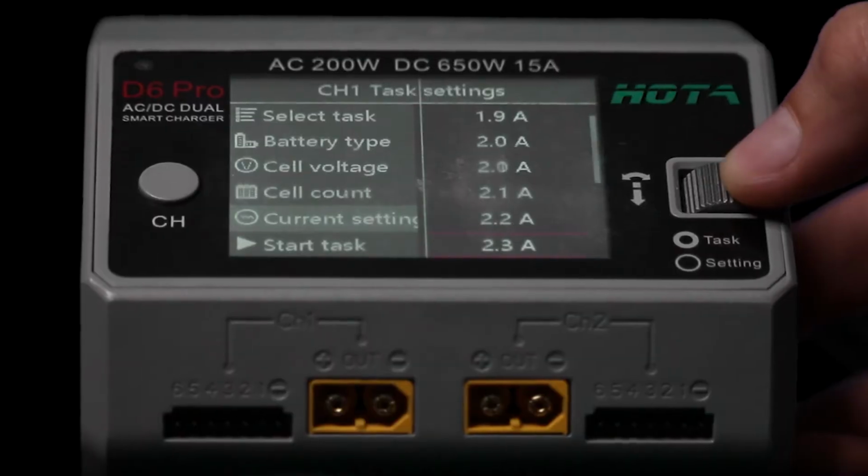Well, every once in a while changed. It started to be every other day to every day. So now my batteries were charging at 2 times speed. It started to degrade the batteries. So what I wish I did is only charged at 1C, and maybe out of the week, maybe once, if you really needed it, charge at 2C. But most of the time, now I only charge at 1C, and I know to charge the batteries beforehand, so then I'm ready to go fly.